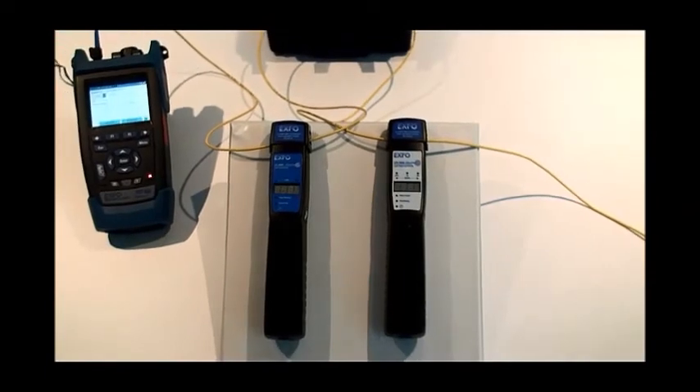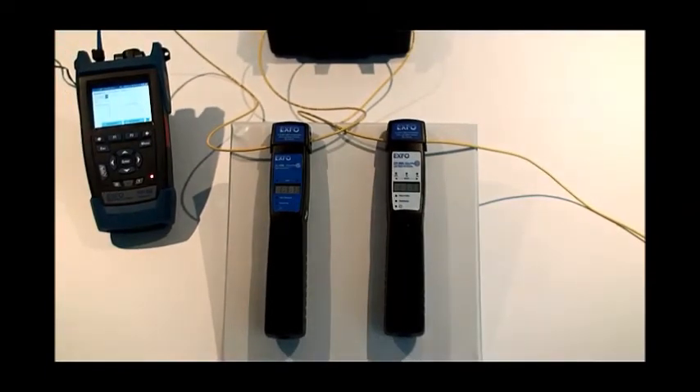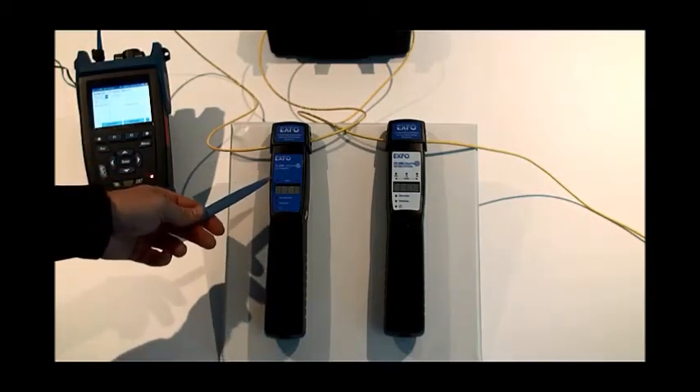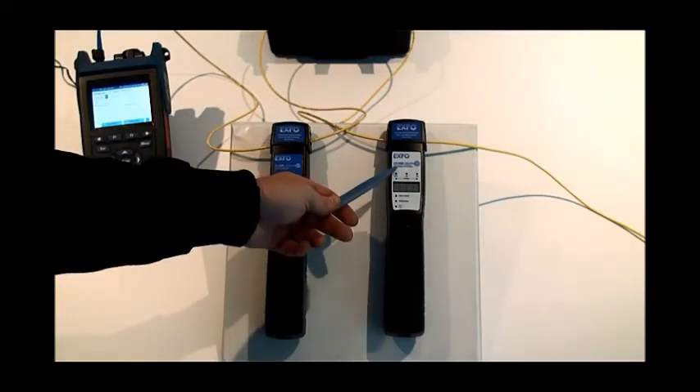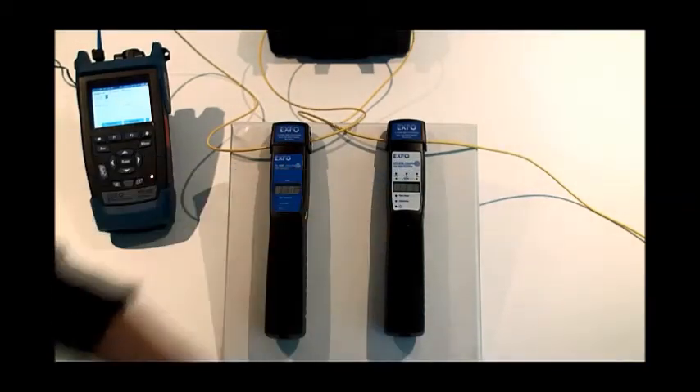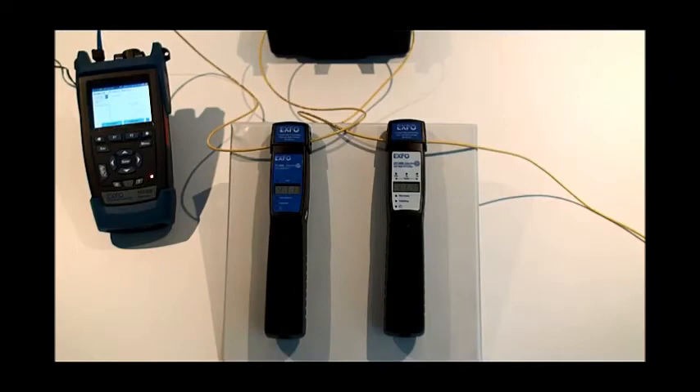When using an LFD250, the LFD250 unit will not be able to detect this tone generator — that is an important detail to mention. These are Generation B units, the TG300B and the LFD300B. Their predecessors would take 30 seconds for the positioning mechanism to activate, whereas these new units now synchronize and activate in less than 6 seconds.